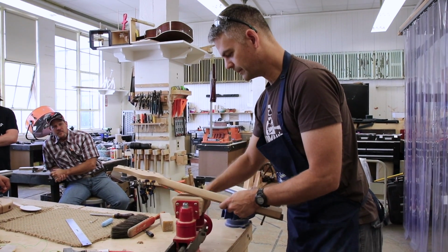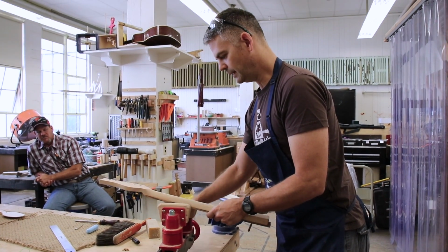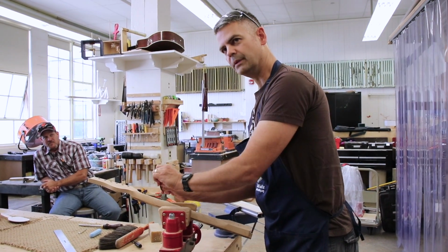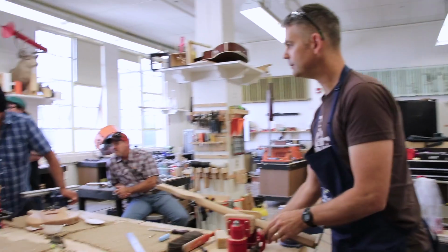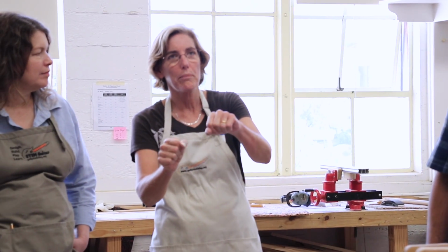And then you always push against, you push, you never pull? Yeah, you probably could. Yeah, but I pull. Do you? Push, yeah. For me, I like having my thumbs behind, but yeah, you could pull this way. One thing when you're doing the side where the glue is, make sure you're leaning away from the fretboard so you don't rip out a fret slot. Oh, good.